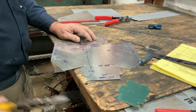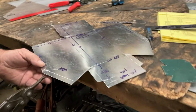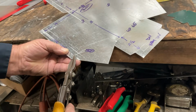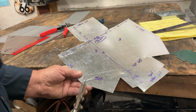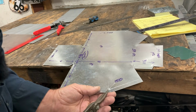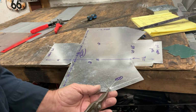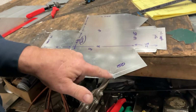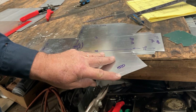Now, whenever we bend this up, let's go back to the notching. I can see it right here, right? So that's my first cut. I'm going to my 75-degree mark. Like I said, some of you are going to go, oh boy. Some of you are going to go, yep, wouldn't have it any other way. So now that I'm marking, I want to make sure that my snip is covering the drop. But just for fun, cover it with your finger.